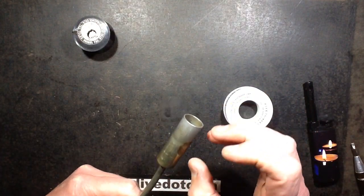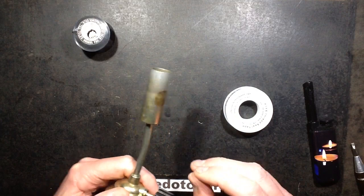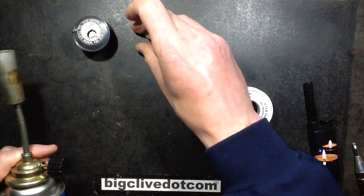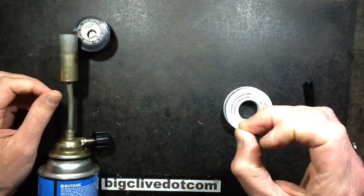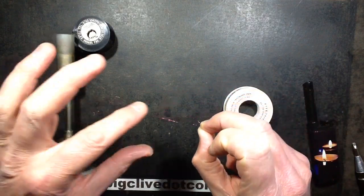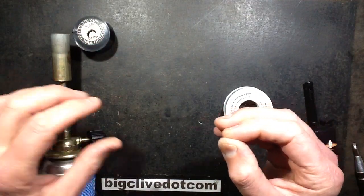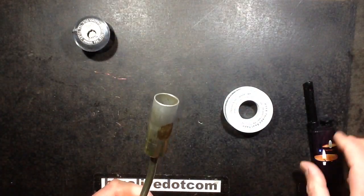Initially I got a blue flame, but it was really deep inside — not a lot at all. I wondered if the little valve had jammed up, because it's got a very tiny orifice. So I took a bit of very fine wire — 0.1 millimeter, the only size that would actually go through that nozzle — poked it through and gave it a clean out, and now it does work.